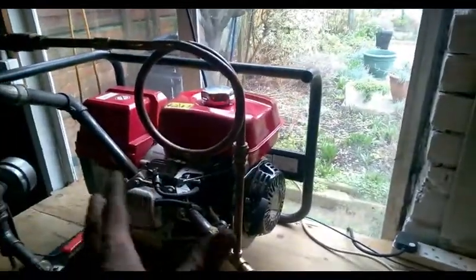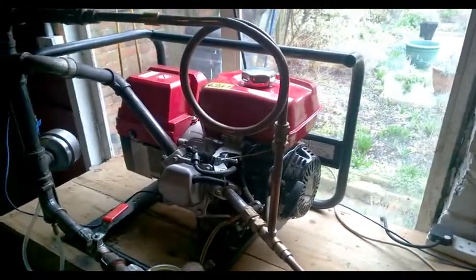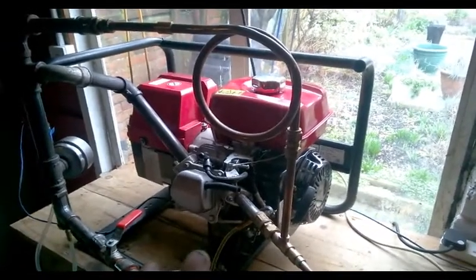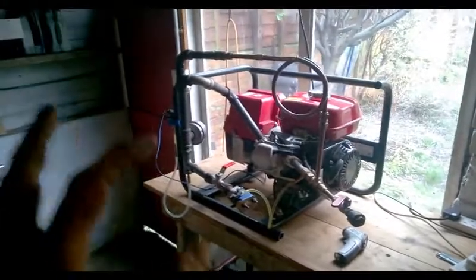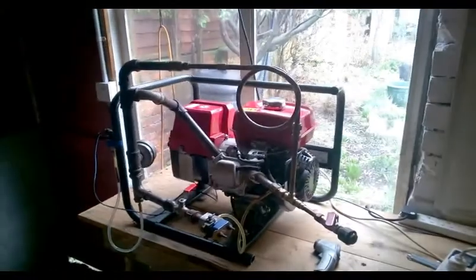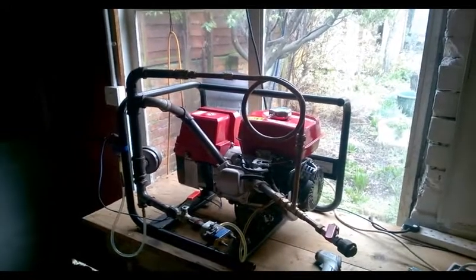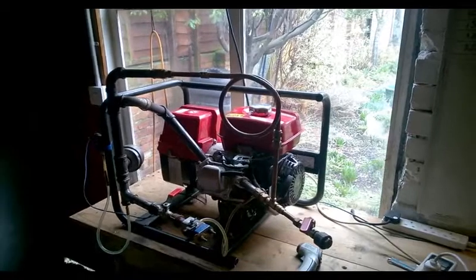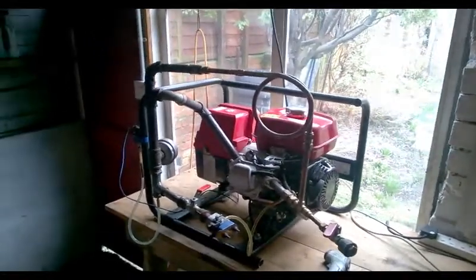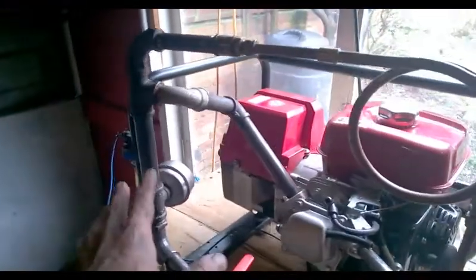This type of engine at five to six hundred watts would run for around three quarters of an hour - maybe a little bit more, maybe a little bit less - on a litre of fuel. Two days ago this engine - and it wasn't quite as perfect as it is now - had a 70 percent increase in efficiency and actually ran for 40 minutes on a half a litre of fuel knocking out five or six hundred watts. The emissions off these engines are super super clean.